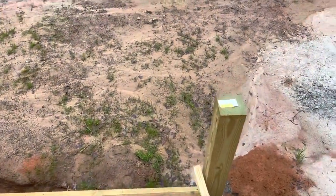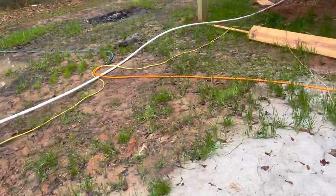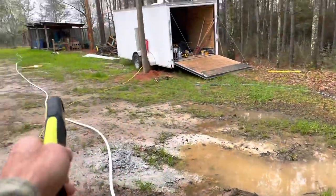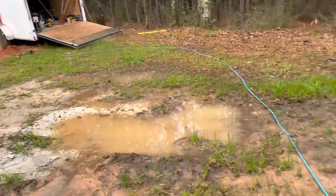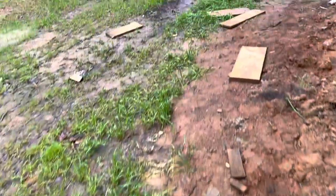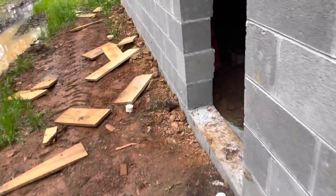It's been a raining, nasty mess — terrible. Y'all excuse the mess. The water line right here — I got a trench it in, one-inch PEX all the way to the road, all the way to the meter out there. I still got to bury that, but I wanted to pressurize everything first so if any water started hitting the ground, we'd know we had a problem.